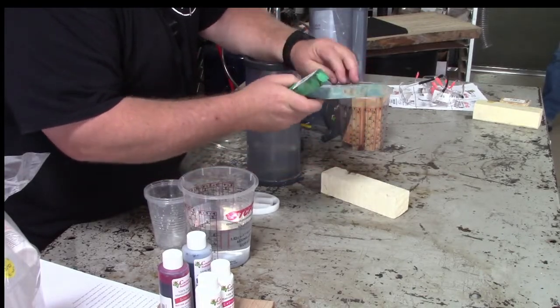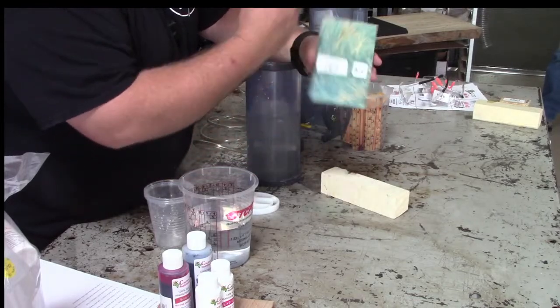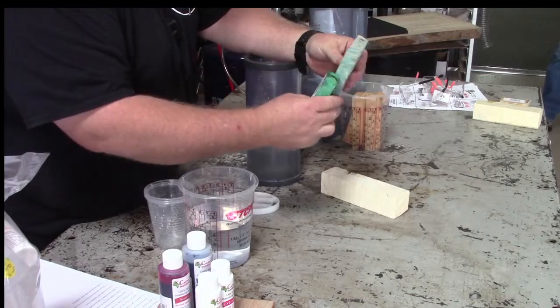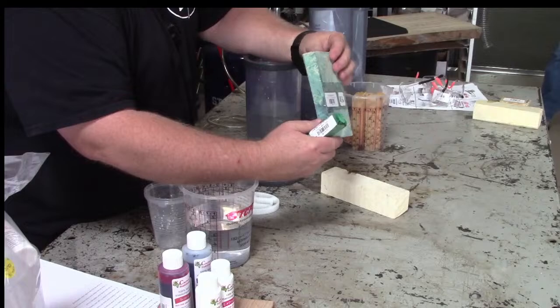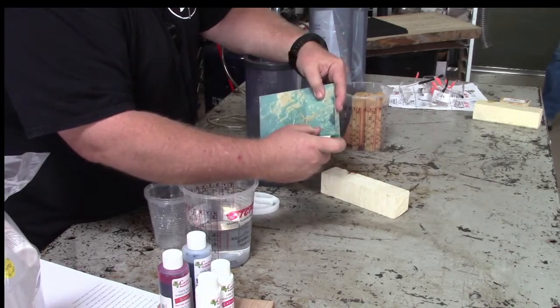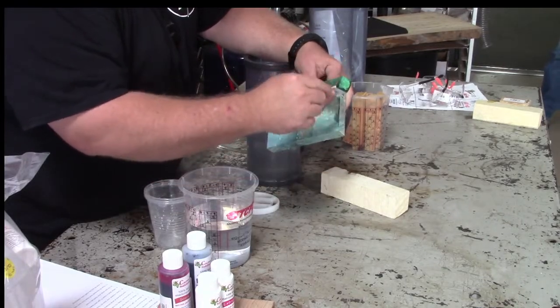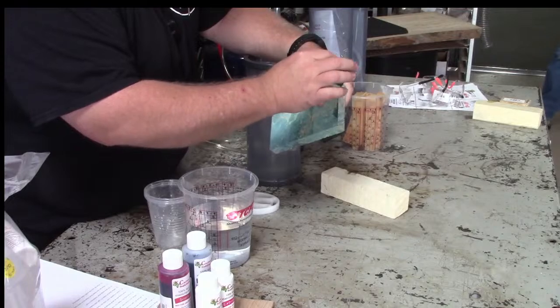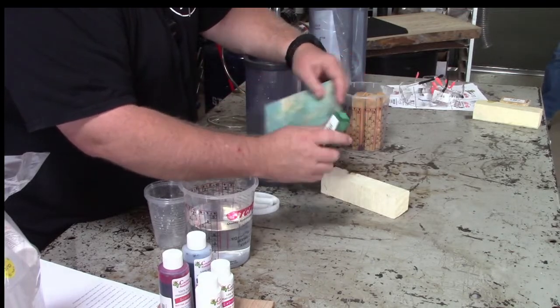Sometimes they'll be a little rough from the resin curing on the surface, so we just hit them on the sander real quick to knock anything off. It makes them look better, and it gives you a better idea of the material too. You can always look at the ends. That's a good indicator of how much your resin penetrated. If you're doing a pen for the first time, just cut off half an inch if you don't think you'll need that, and that way you can see if it got all the way through. Especially if you're doing color, you can see that.